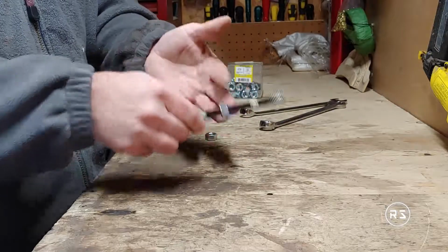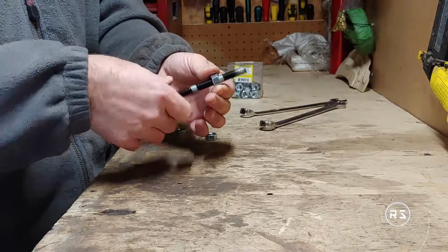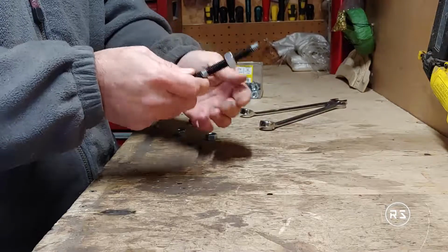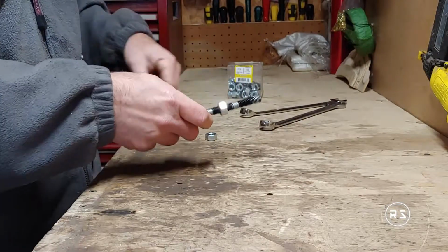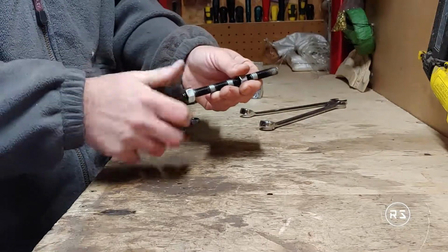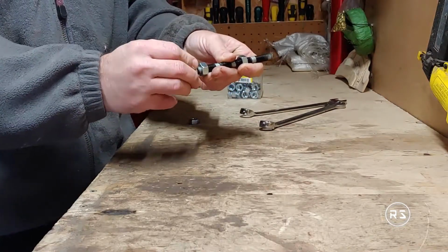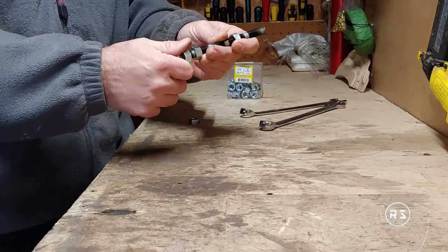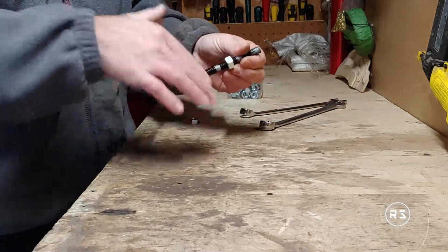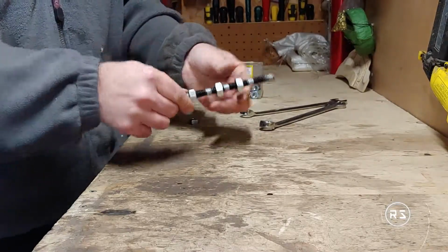So the way to go is to put some nuts on the rod so you can put it in a vise without damaging anything, and so you can have some control on it. It is strong enough so you can work around it without damaging anything. In this example, I will put 3 nuts, but I'm pretty sure you can do the same using only 2 nuts. But I rather use three nuts because my vise is not super strong, and I want the rod to be very steady while I'm working on it.